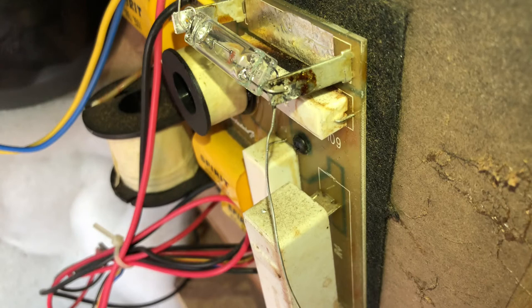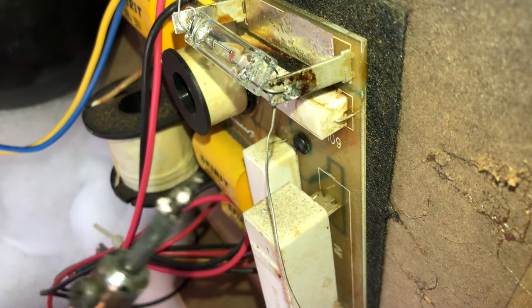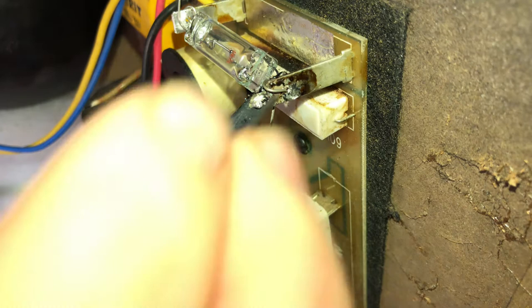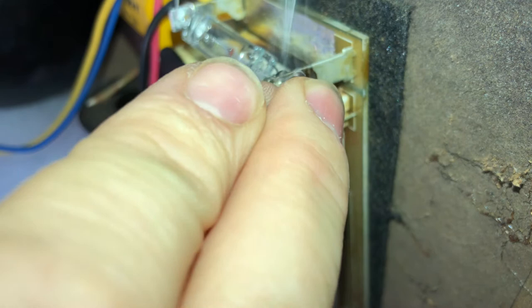And what you want to do is warm again. You don't want to put the solder on the tip itself, that's not the way you do it, because of cold joints and bad contact. So you want to warm the components up. When that piece is warm and that piece is warm, which won't take long, when you put the solder on, it's actually melting now. It's not melting on the actual solder head itself, and that will pull itself straight into the hole there, look. And that's done. That's perfect, look.